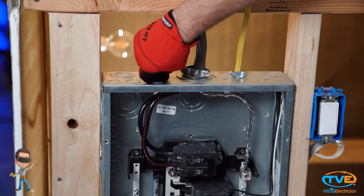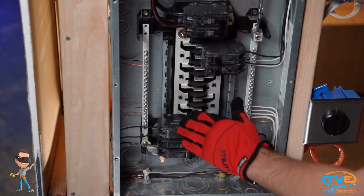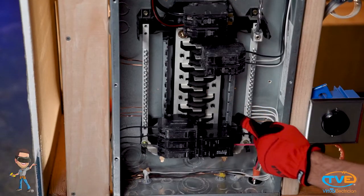They usually just pop in. As you're inserting the wire in the panel, you want to be careful about what you're touching. Make sure you are also using your insulated tools at this point. You cannot touch here, here, or here. These are the bus bars — that's what the two legs of power coming in are attached to. Anything touching this that is metal is going to be energized. This bar and this bar are okay to touch — that's your neutral and ground bar. All these wires are okay to touch as well. They have insulation on them to prevent you from being shocked.